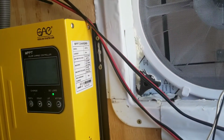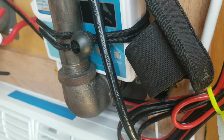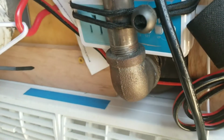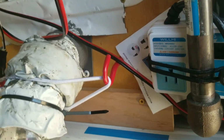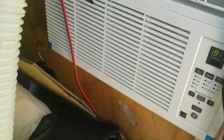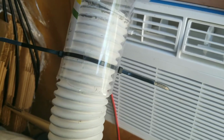I'm showing 12.63 volts, which is pretty good. I'm pulling down about 264 watts off the sun, at the particular angle where I'm sitting. But the sun is going to be affected by the trees pretty soon, so I'll have to stop the test at wherever it is then. Yeah, I think at this point I would put it at about 3 hours. I'm beginning to get some switch off. So I'm not exactly sure what, but it appears to be taxing the system somewhat.